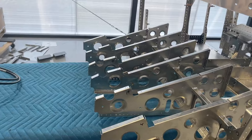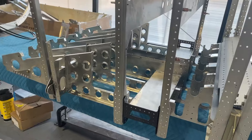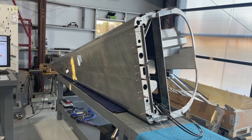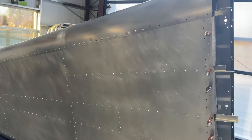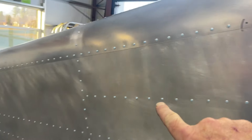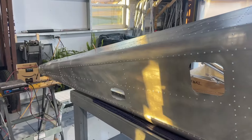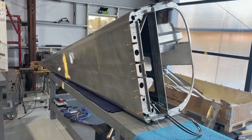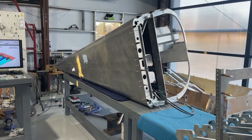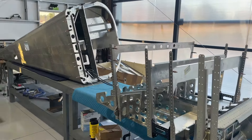What's going to happen next is we're going to join the fuselage — the rear fuselage to the center. The reason the rear fuselage is up on its side is I wanted to go ahead and fill all these rivets before joining them, so I'm not having to worry about that later. I'm taking a little extra time to do that so I don't have to do it on my back. That'll dry tomorrow, I'll sand it, and then I'll right the rear fuselage back to its original position and we'll start joining the center and the rear fuselage together.